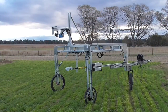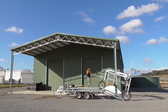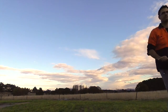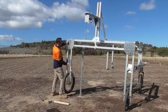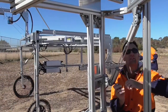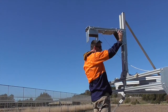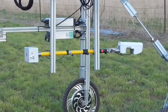As the name suggests, the Phenomobile Lite was designed to be light and portable for convenience with transport and operation. The frame is constructed from lightweight structural aluminum and can be adjusted to accommodate plot widths that fit a wheelbase from 1.75 to 2.2 meters. The buggy has a maximum clearance of around 1.5 meters. Instruments are attached to the instrument boom, which can be adjusted to a height of 2 to 2.5 meters. If you have an NDVI green seeker, this can be attached to the mid-frame bracket.